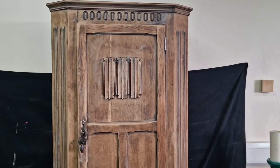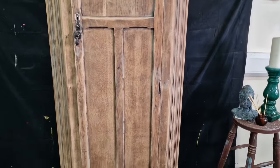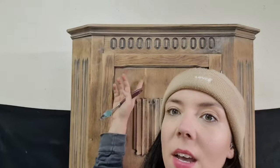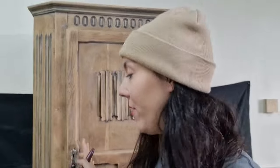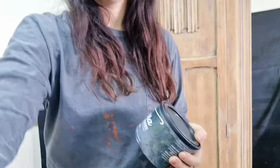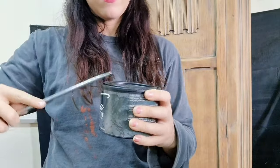This is what we've got — it's not perfectly sanded, still a little rustic. I haven't got into every nook and cranny and there are still tiny bits of varnish left over, but that's fine. What I'm going to do now is a dark paint wash — I'm going to mix some paint with water, make it really watery, splash it on, then wipe it off with a rag to make it look more rustic, darker, moodier, and older. I much prefer raw wood over varnished wood any day. Here I have Onyx in the TerraClay paint range.